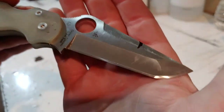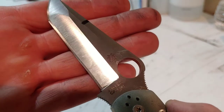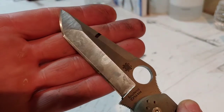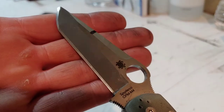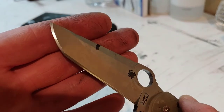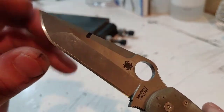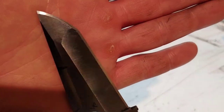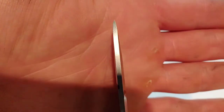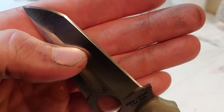I went all the way through to my last stone. I'm still going to do one more pass around each angle. Even though technically I could finish right now — I got a burr on this side all the way across and I could just knock the burr off — I'm going to do one more pass around and see if I can get this tip just a little tiny bit more acute than it is right now. Also, the tip is almost perfectly even on both sides, but this side is just slightly beefier than this side. Let's see if we can clean that up with just a couple more passes on the opposite side.